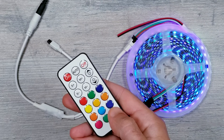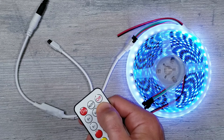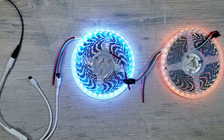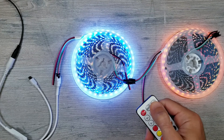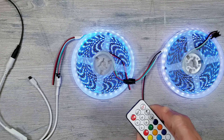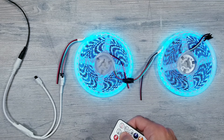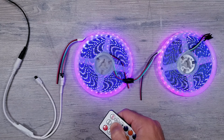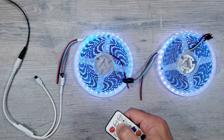As far as I could tell the 3 amp supply was enough to power the entire strip at full brightness on white settings with no visible voltage drop in color. Now if you connected two of these together while using the same 3 amp supply, voltage drop definitely became noticeable on the max settings. But other than having them on solid white, all the colors and pretty much all animations still looked and ran great on the entire 10 meters at half brightness using only the 3 amp supply at the beginning.